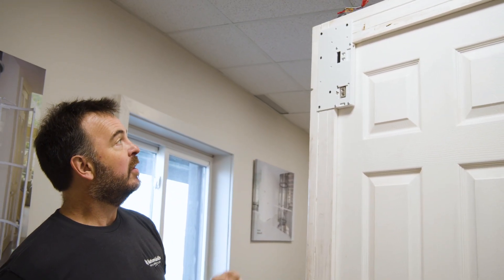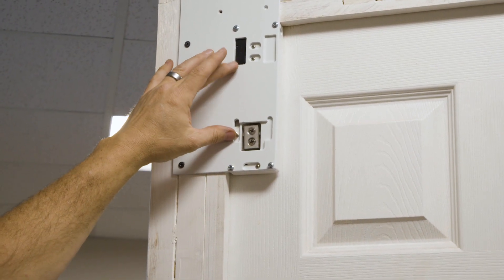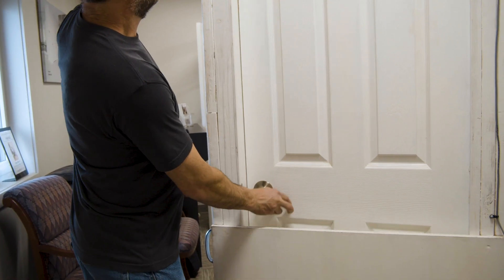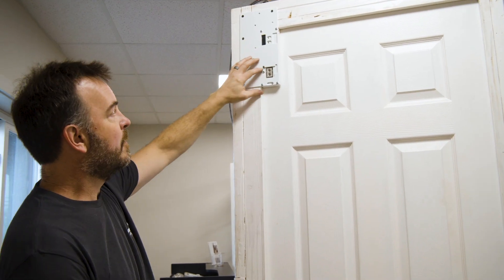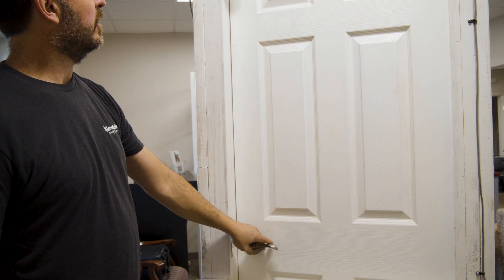Now we have this powered up. There's a call button right here on this side which will simulate placing a call and holding the solenoid signal for about 10 seconds. You can see this is the manual release latch. So if somebody needed to get out of the cab, they can just lift up on this and open the door — that will release the latch for the door. If I hit the call, it's going to lift up that latch and unlock the door.